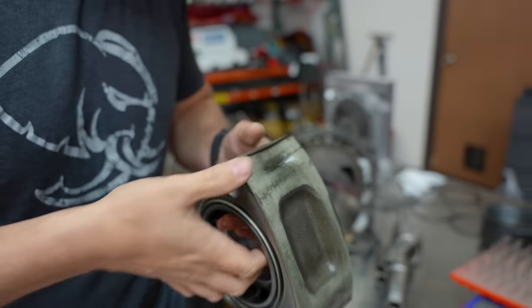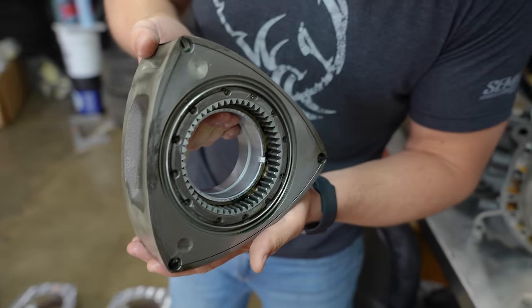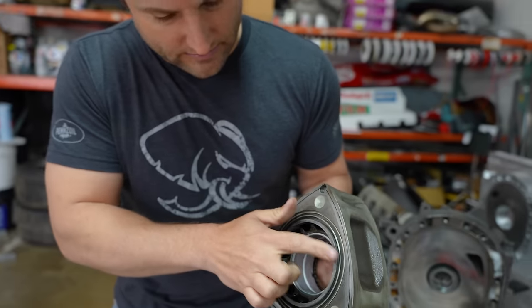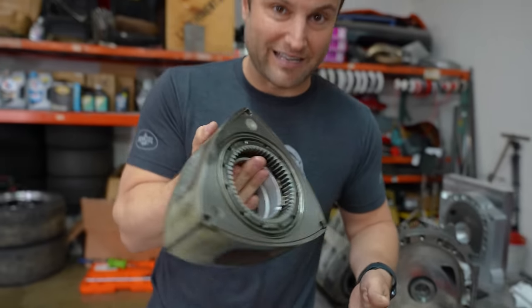For one, it's not my tuning, but it was because the plates that are billet swell under heat, and so they pinched the rotors in. So if you're going to run a billet motor, you need to clearance your rotors on the sides more. It pinches the rotor between the plates, causing friction, and then that heat is what ignites your fuel without a spark. And this is actually very sharp because of that. Those were clearance for a stock motor, not a billet motor.